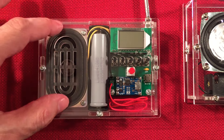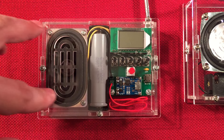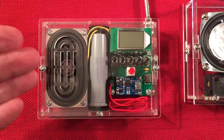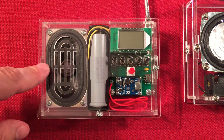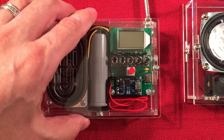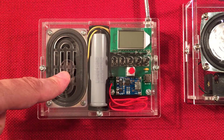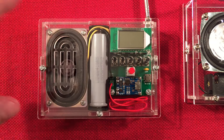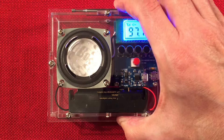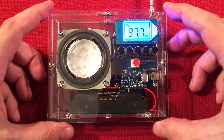When using just the speaker only on the older kit, it doesn't draw much because it's a simple paper speaker — high tinny sound, but draw is around 50 to 70 milliamps. So the older kit is the one to get if you want to listen quietly and aren't interested in bass or heavy tones. Classical music, news, talk would sound great on the older kit. I recommend that kit over this new one.